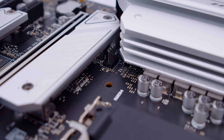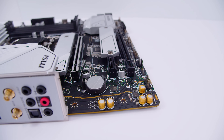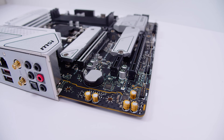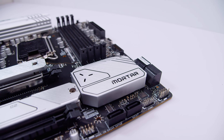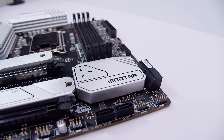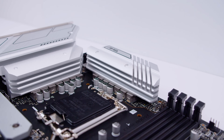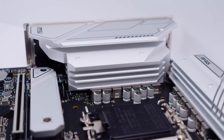There's also another sneaky PWM fan header above the top M.2 heatsink. In terms of PCIe slot configuration, there is a full x16 PCIe Gen 4 slot at the top - that's the one with the silver shroud. There's also a PCIe x1 slot and a PCIe Gen 3 x4 slot down the bottom, which is x16 size. This features Intel's B660 chipset with a big heatsink to cool it, and a 12+1+1 phase digital VRM setup with quite substantial heatsinks.